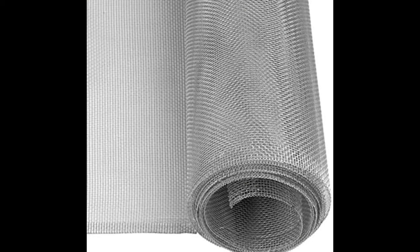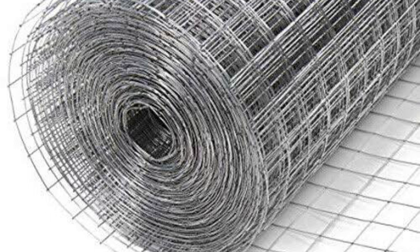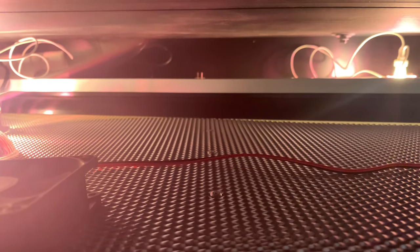The design of the mesh tub lid is actually the most crucial component of this rack. I went with an aluminium frame because it will stay straight and won't bow downward onto the tubs, and it's strong enough that no lizard can flex it — so as long as the aluminium frame surrounds the perimeter of the tubs, the lizards can't escape. For the mesh material, I first considered aluminium fly screen — heatproof, but too flimsy. Perforated metal sheets are strong and rigid but too expensive. Welded mesh is rigid enough if the wire gauge is thick enough, but the openings are too big. I finally settled on aluminium expanded mesh: not too flimsy, can hold the weight of fans and lights sitting above it, and lets a decent amount of light through.